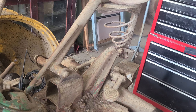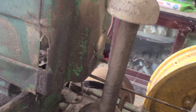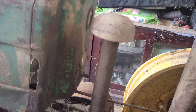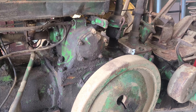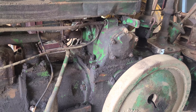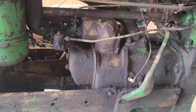There's an aftermarket seat, which is not as desirable — I think I have a replacement for that. The gauges aren't very good. I haven't checked for oil pressure yet, but what I'll do is unhook the oil pressure gauge line, spin it over, and see if I get oil coming out. The oil pressure on these tractors is so low that as long as I have oil coming out, I can be confident it's good.